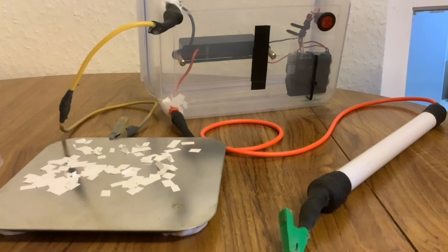That first flocking machine actually broke. The modules are quite highly stressed and quoted as having a life of a thousand hours, but ours stopped working after just an hour or two. Paul suspected the cause was that, being mounted on a block of wood, some of the high voltage leaked back into the input on the thin wires by getting the leads close together. So he decided to lay it out in a plastic box.